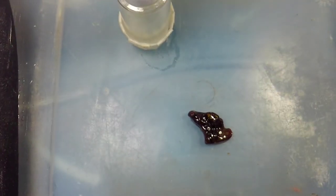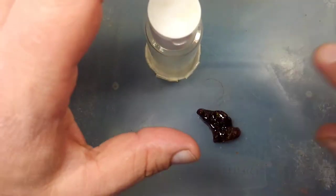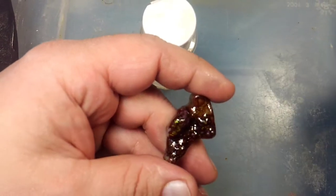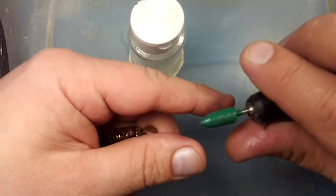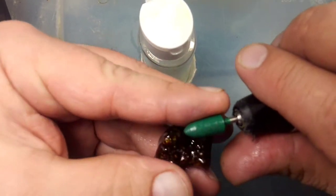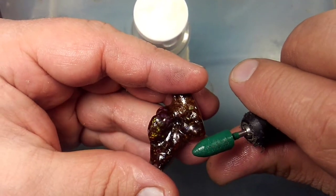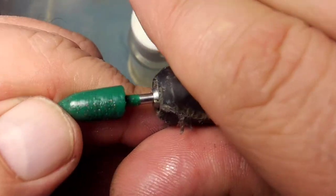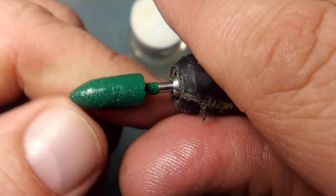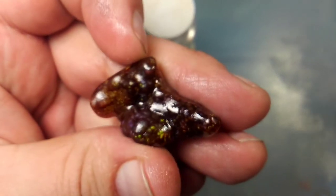These are the ones that I really enjoy using. I've got a wide variety. I like to start with the coarsest. Even if you're only using it for a little while with the smaller stone, you want to go over the entire stone — and this is the coarse one. You can see the little diamonds and metal embedded in that. It's impregnated all the way through so you get a nice clean even cut the whole way through your stone.